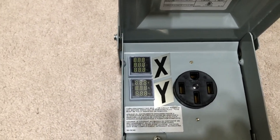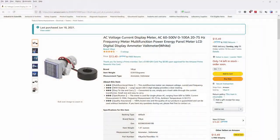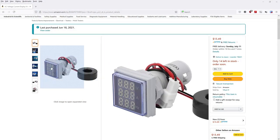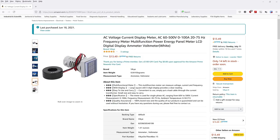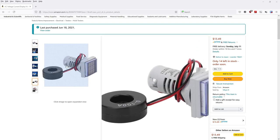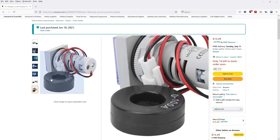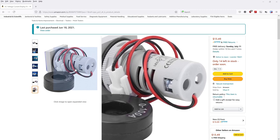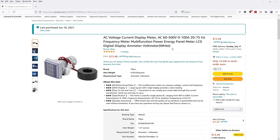I got a little fancy and got those amp meters. They were about eight bucks when I bought them — the price has raised some but it's still pretty reasonable. Use a stepper bit to drill your hole out — I believe it was a three-quarter inch hole — and you can run those through the panel mount and they just clamp down on the backside. They have a little coil that you run around the output that goes into the dryer plug.